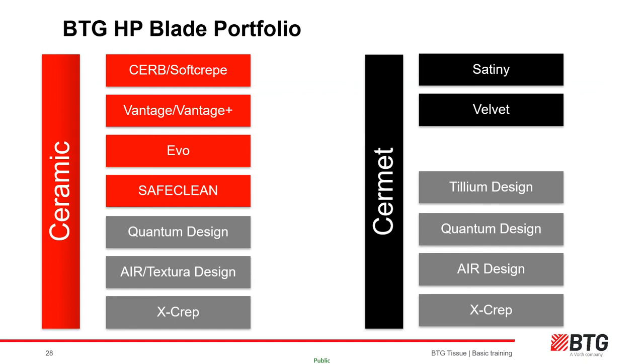More consistent and optimal doctoring and creping over an extended period of time encourages more consistent machine productivity and quality throughout converting. However, a high-performance blade is not a magic bullet — it is after all just an advancement in material science. It will still wear, but depending on the hardness of the environment it operates in, having a stable process and soft but robust coating layer will only extend the lifetime of these blades in comparison to one another.